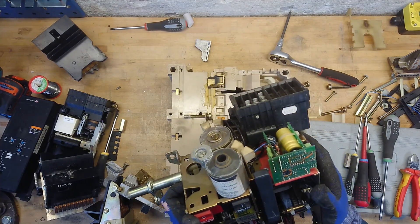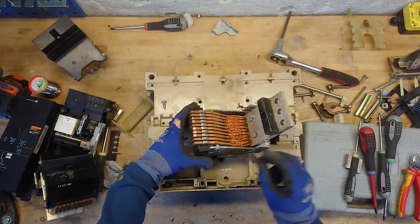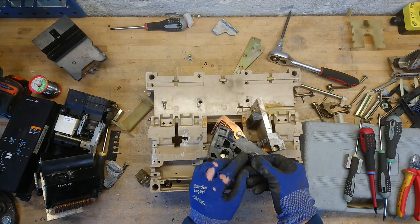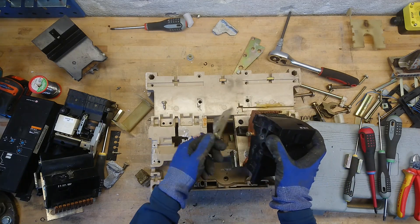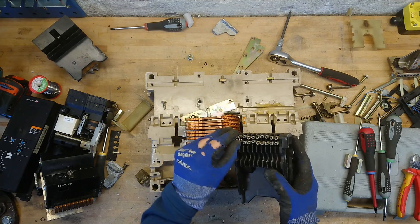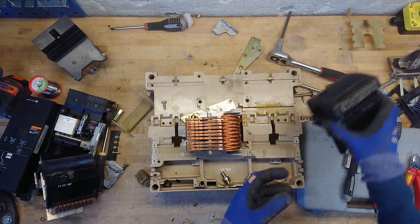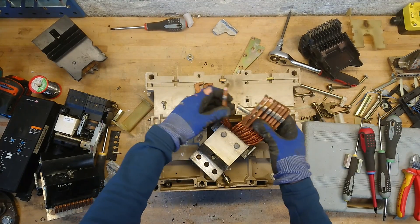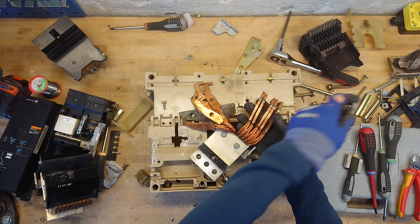Let's take a look at the switching parts. You can feel there's some spring action there. Here we have the pin-connecting spring that I had to press to the side in order to disconnect it. Here we have the axle sitting with double springs — so if you have one spring fail, you at least have one other. Again, redundancy all over the design — besides which you also have the ten arms already. A lot of thought and design has gone into making this last for a very long time under very harsh conditions. You can have a lot of parts fail and operation is still within normal specifications.